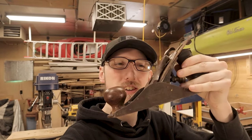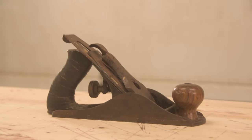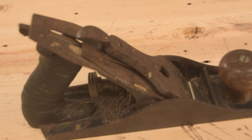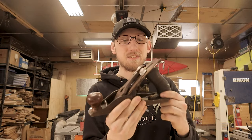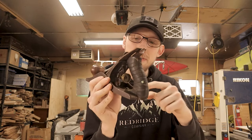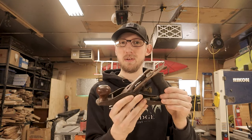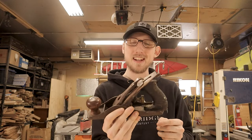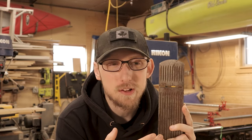Welcome back to another video. In this one we're going to be restoring this awesome antique hand plane, getting it back up to functional, usable condition so I can put it in my toolbox and actually get some use out of it on some of the upcoming projects. This is a Stanley Bailey number four type 11. I was able to identify it as a type 11 because of the small adjuster knob as well as three patent dates behind the frog, which pretty much perfectly identifies it as a type 11, meaning this hand plane was made sometime between 1910 and 1918 — making it over a hundred years old. I believe this is now the oldest tool that I've collected and I'm really excited to get it cleaned up and back in service.